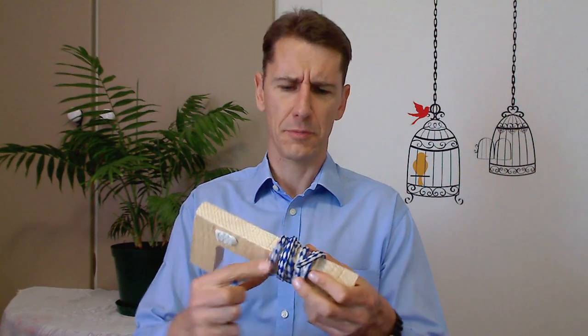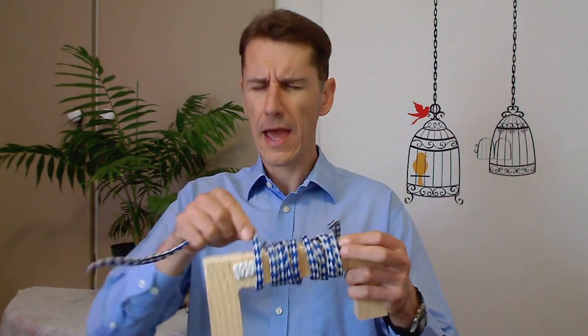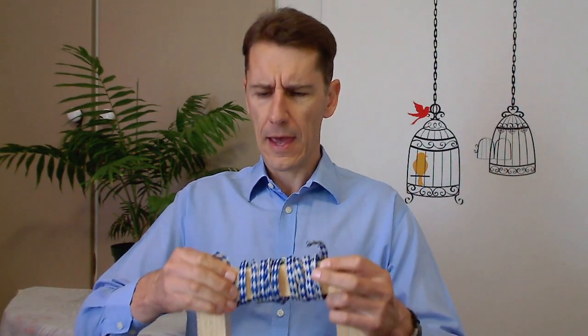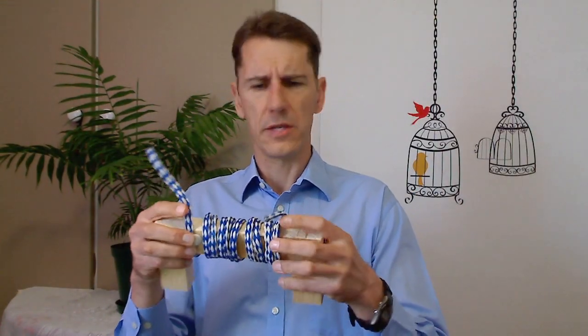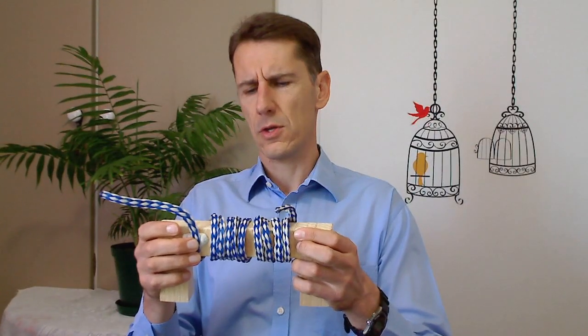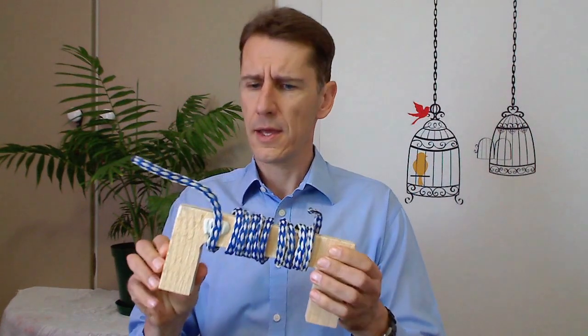In this case the coil is a piece of rope, and we would wind it around our core material as many turns as we can. Then once it's wound, we of course need to connect this to a power source. Once connected, this becomes magnetized with a north and a south pole, and the purpose of this would be to pick something up — for instance, another piece of iron.